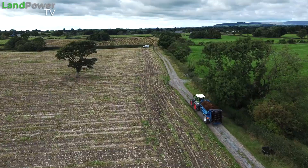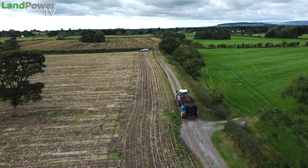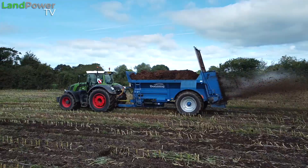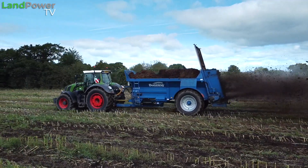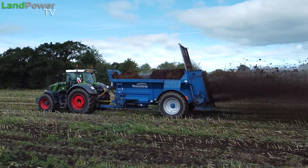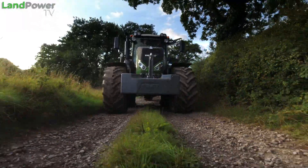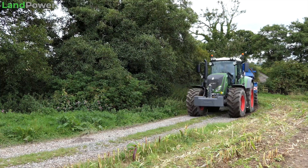Right, on with this little test with the muck spreader. Let's start with the conditions we are faced with, because it's those conditions that we have to weigh up and then decide what sort of tyre pressures we want to go for today. We are muck spreading on some maize stubble land. There has been a little bit of rain but on the whole it has been pretty dry around here. For the transport element - getting from farm to field and back - we are in a nice ring-fenced area, just up and down farm tracks, so we've got a nice mix of track work and field work.